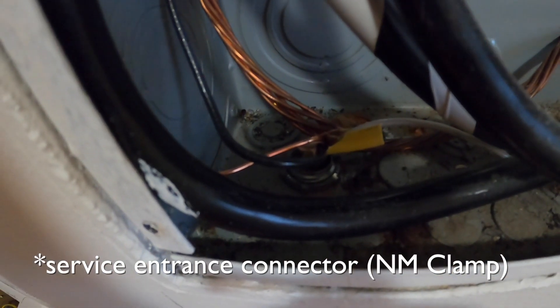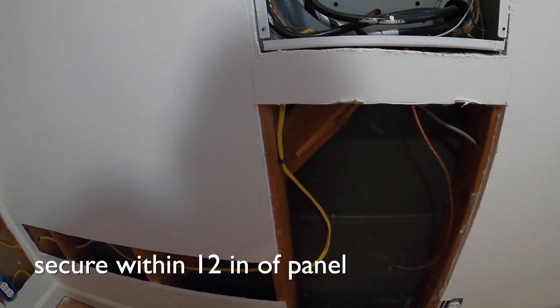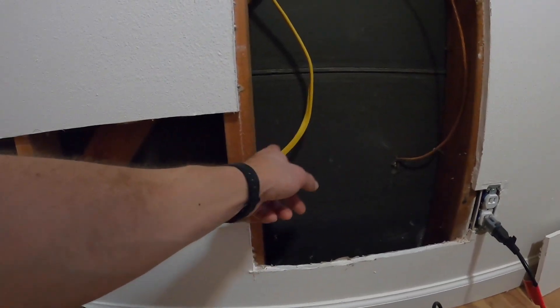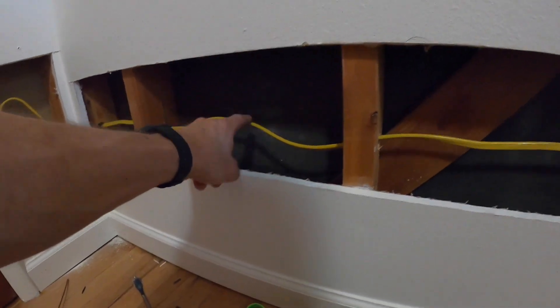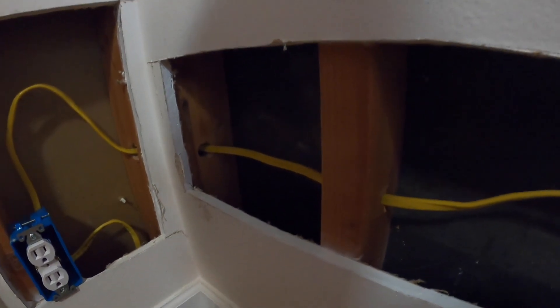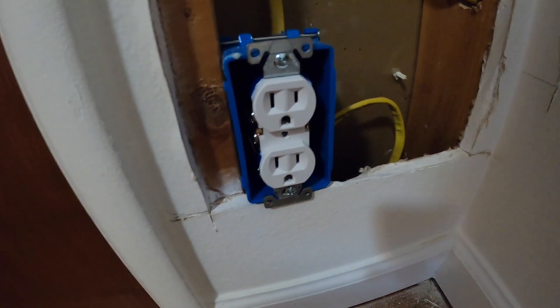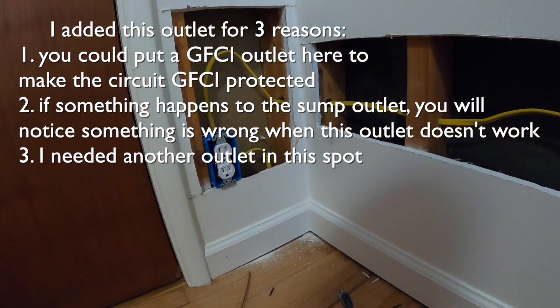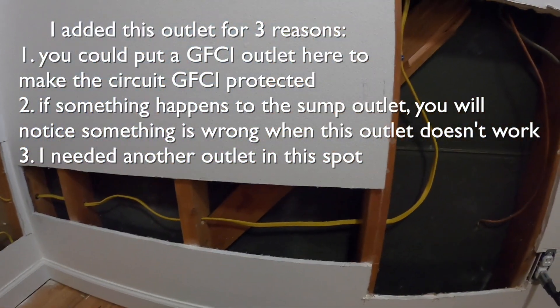All I do is knock out one of these knockouts and put the cable through. You're required to have a staple within — I think it's eight inches of the panel. I've got the cable coming through here. Try never to have any sharp bends — do nice arcing bends. I always like to leave just a little bit of extra flex in the cable so it can move or you can pull through extra cable later if needed. It's all wired into the outlet, which goes down to the sump pump below. Next step is to put the drywall back on, button everything up, and we'll see you next time.